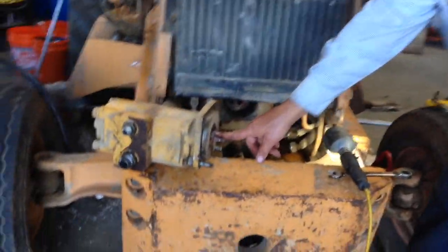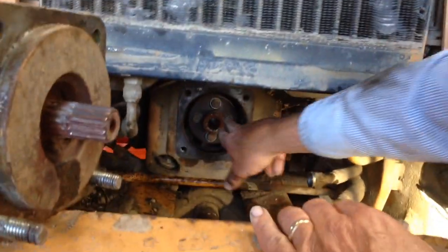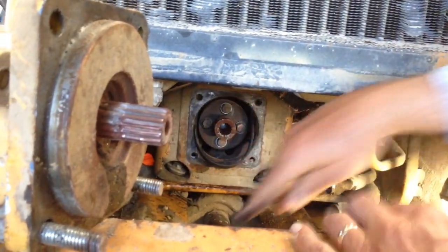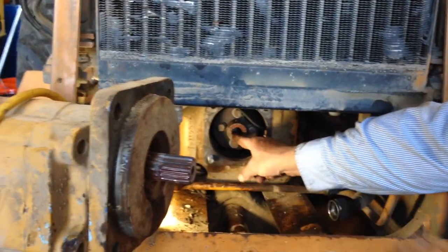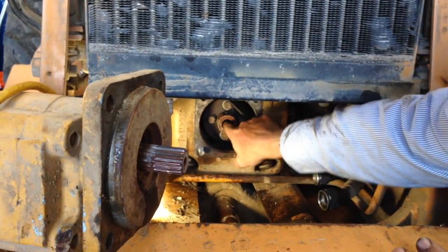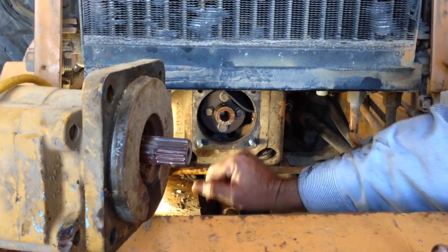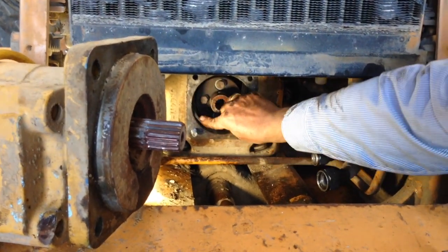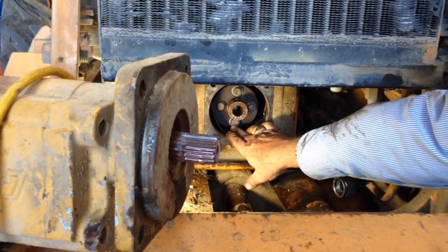This pump plugs into this shaft down here, and this is how come we had to pull the pump out. Here is the pulley right here — this is the old pulley, and it goes on right underneath it. Because the hydraulic pump fits right into there, if the shaft is worn on the pump, you'll also want to replace this guy — there are only four bolts that hold it on. Here's the brand new belt. This is the problem — why you have to take the hydraulic pump off. The belt goes down and underneath, and the belt is now installed. That's why we have to pull the pump out.